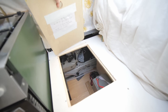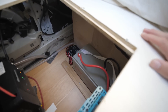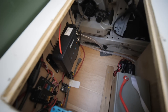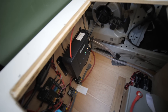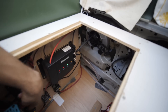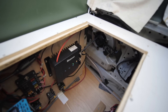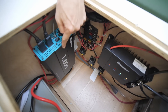Let me give you a little tour of this new power setup. I made a little diagram on the underside of the panel so I don't forget where all my fuses are. On the right we have the 120 amp hour AGM battery — I will replace that with lithium at some point, but it'll be at least a few months. This is the charge controller — it's a 30 amp MPPT and DC-to-DC charger all-in-one built by Renogy. I have the solar wires running into the charge controller, and I used a four-gauge cable to connect the positive terminal of the starting battery to the charge controller, run through a couple of breakers. I followed Will Prowse's wiring diagram exactly — I'll put a link in the description. I set it all up, powered it on, and haven't really had to think about it since.